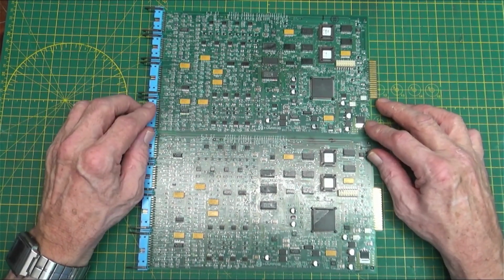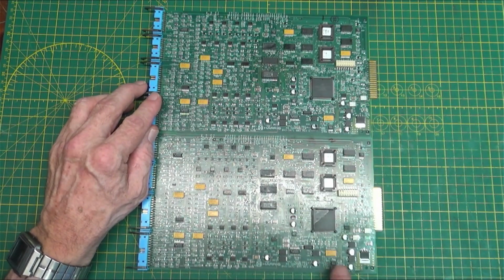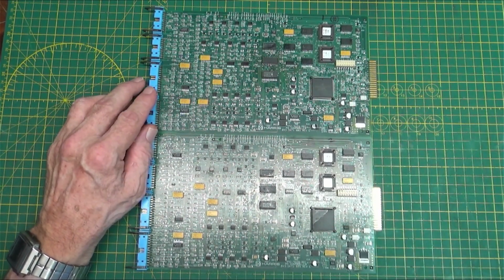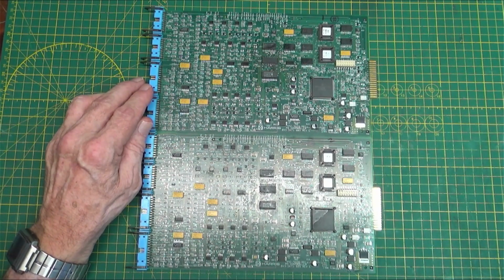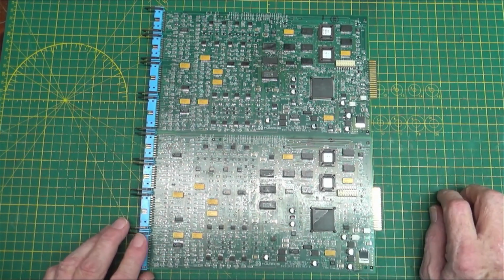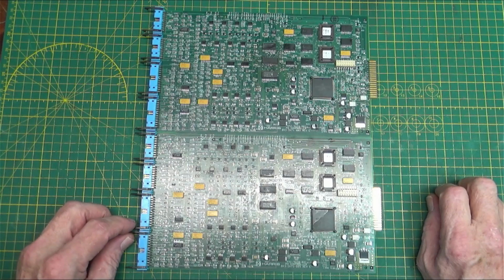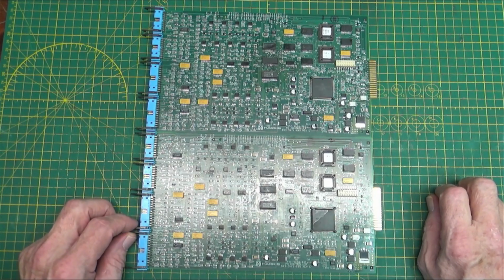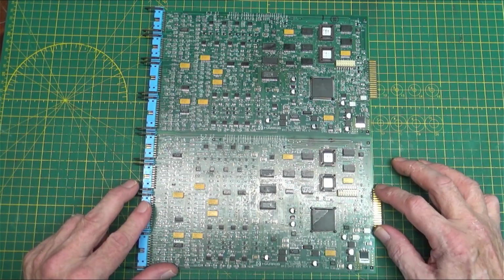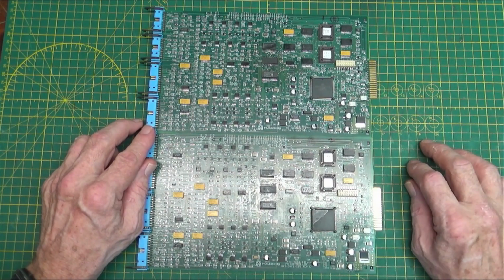But anyway, in the process of looking around, I noticed that it's got a bunch of these little capacitors on here, and all of these capacitors were shot. I mean, just shot. The values were way off. Most of them had ESRs in the, well, my meter will read 0.14K, so 140 ohms, and you want them to be down somewhere for 10 microfarads. You want them to be somewhere down under 1 or around there. And all of them were 39, 50, 140 ohms, something like that.